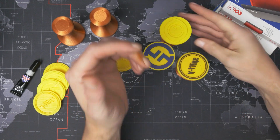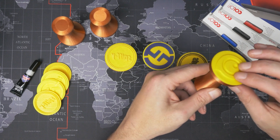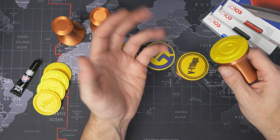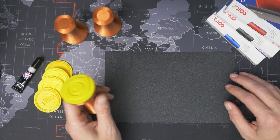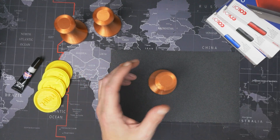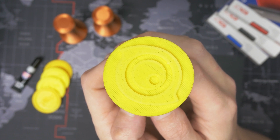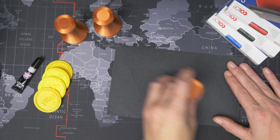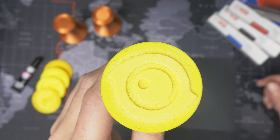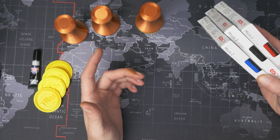But we're not quite finished yet. The problem with 3D printing is that this top surface, while it looks flat, it's not really flat. You've got little bumps and depressions because of just the way 3D printing works. So we're going to need to sand this down. You can sand TPU if you're careful, and I'm using 150 grit wet/dry sandpaper — dry. You'll want to be quite gentle at first so that it moves smoothly across the sandpaper and doesn't dig into the edges. I also like to turn it about an eighth of a turn between each stroke. Eventually you'll get something that looks a bit flatter, then just use compressed air or a dry paintbrush to get rid of the dust.